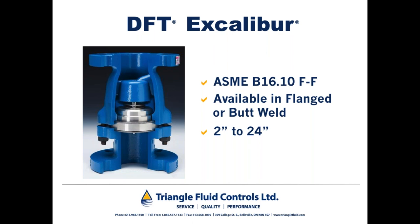So if you were to have a flange swing check misapplied on pump discharge, where reverse flow and water hammer can be a problem, and you wanted to replace it with a non-slam check valve, a DFT Excalibur would be a good choice because you could slip that in without having to make any piping changes. This valve is available in flanged or butt weld ends, and it indicates that the valve is available 2 through 24 inch, which is indicated in the catalog.